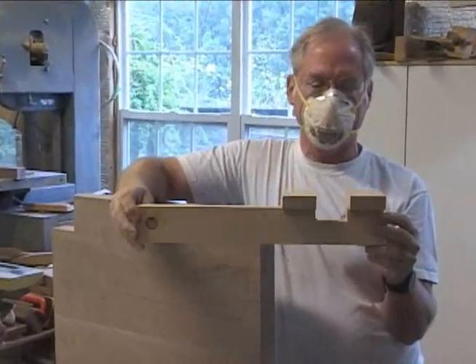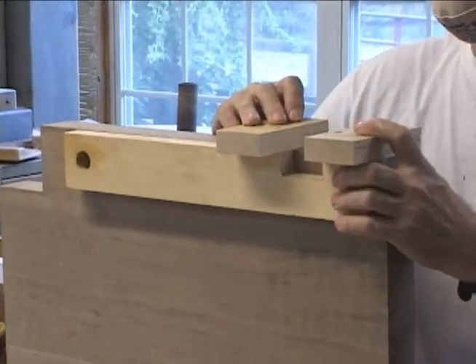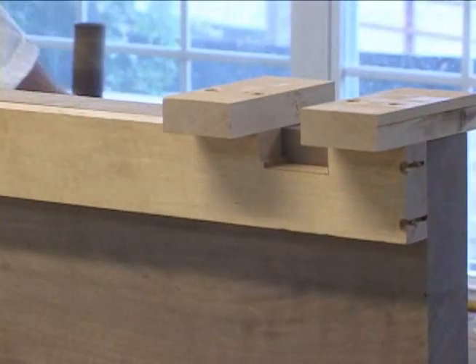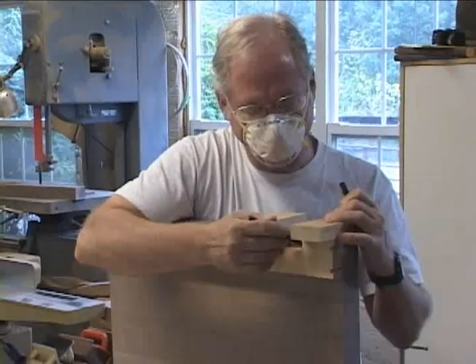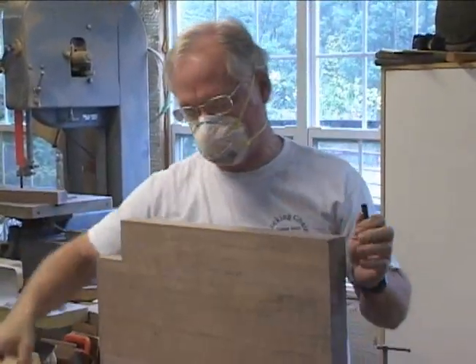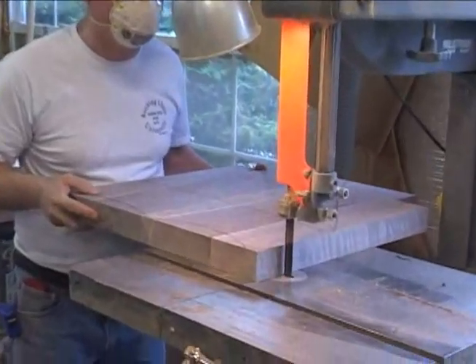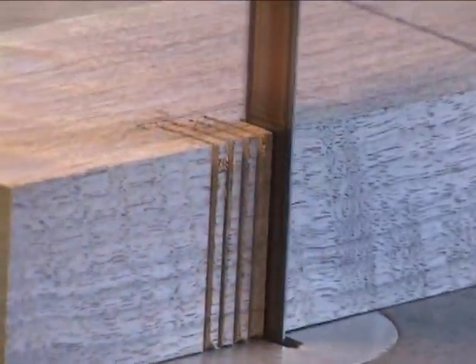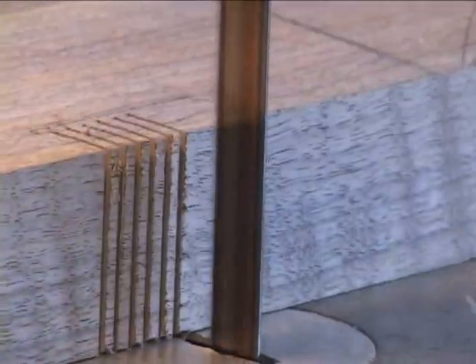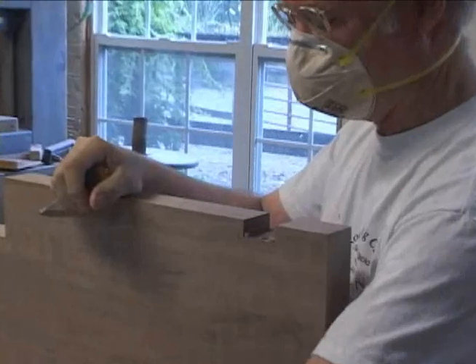Here's your fixture — this is in the paperwork that you have with your video for cutting the front notches. This is for routing the front notches. What we're going to do is also use this to mark the front notch so I can take it to the bandsaw and cut a lot of that material away so I don't have to rout through the entire two-inch board. Now I just take a screwdriver and break those out just like that — so that's what you're not going to have to rout.